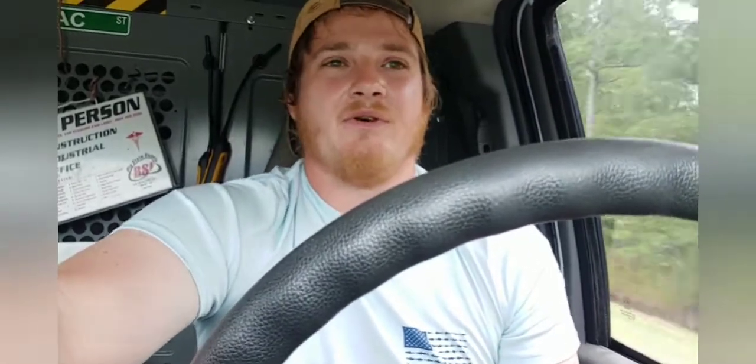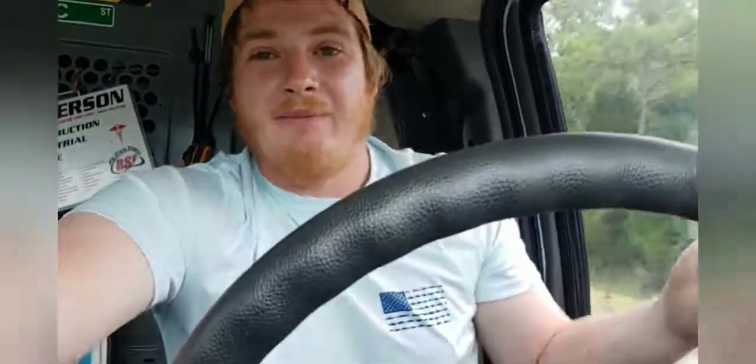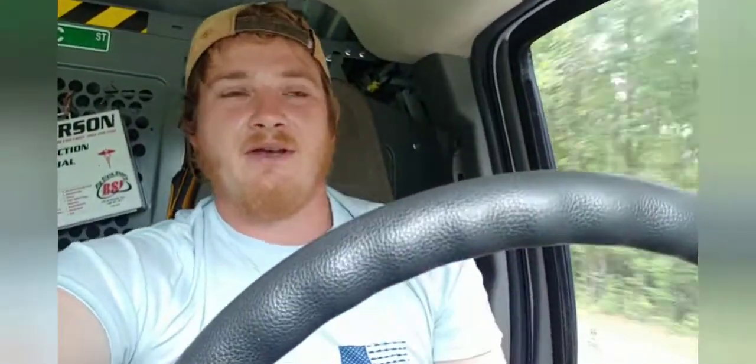Anyway, it's a 2001 American Standard. Technically if they want to, they could cut out that valve and patch it up, but you're throwing good money after bad at that point. Hopefully it'll last her another couple of years, but it's going to need a replacement here pretty soon. It's 2001, you're 20 years old — hopefully you can get another five years out of it and then get yourself a new one. Either way, she's working good, better than when I got there, and that's all that matters. It's a great day in the life of an AC service tech. We're back on to Merritt to see what we've got over there.